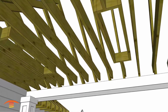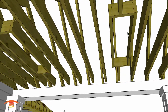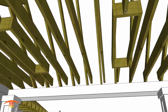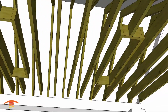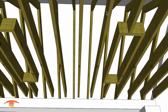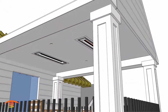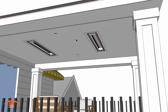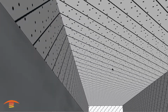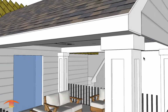I just want to show this as probably my preferred option, because this structure is already built, and you'd have to cut into the ceiling, mount something like this, and brace your structure here so that it's supportive of the ceiling and the rooftop. So I doubt that that would happen, but just to give you a quick idea, this is my suggestion. And it does have a 1 hour firewall rated drywall interior in here, just to keep that in mind. If you're considering that, this is probably what I would do in my application first if I could.